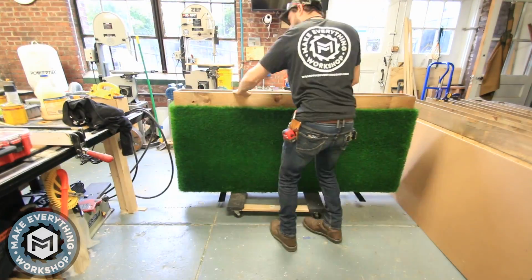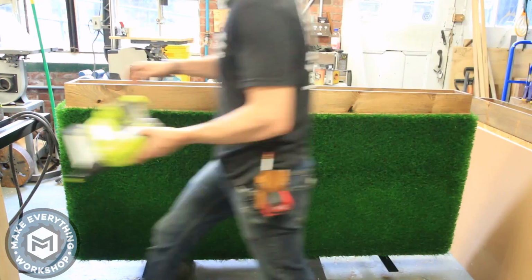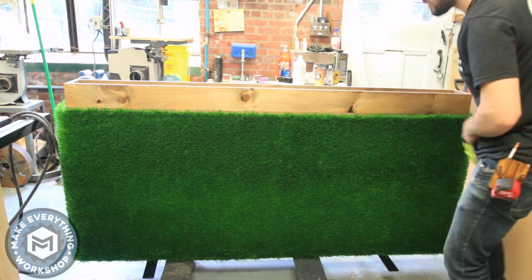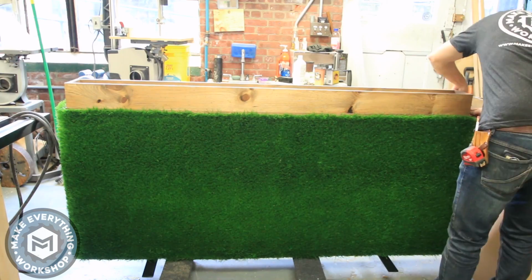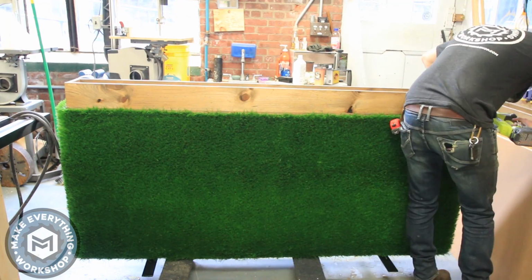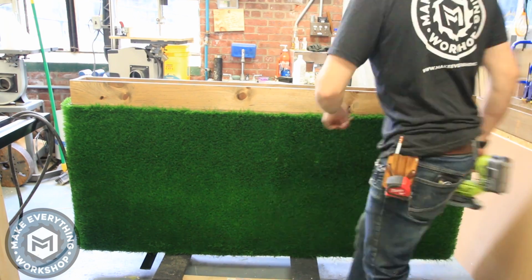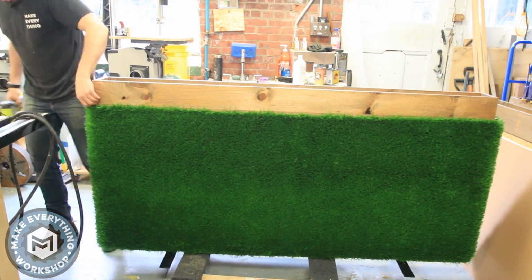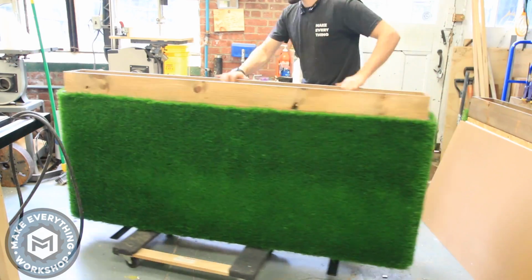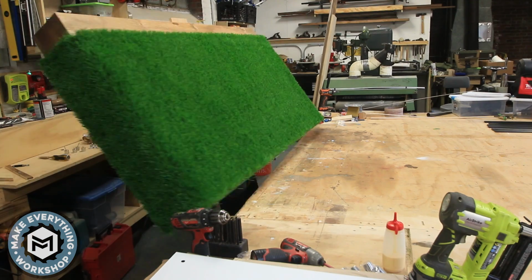And I can add the little trim piece that's going to go right at the top of that grass and wrap around the catch bin to just tidy up the edge of that wood. And this is just some 1/2 inch by 1/2 inch pine that I ripped on the table saw and stained to match. You can barely even see it from a distance, but it's a little detail like that that just makes things a little bit cleaner when you're up close.